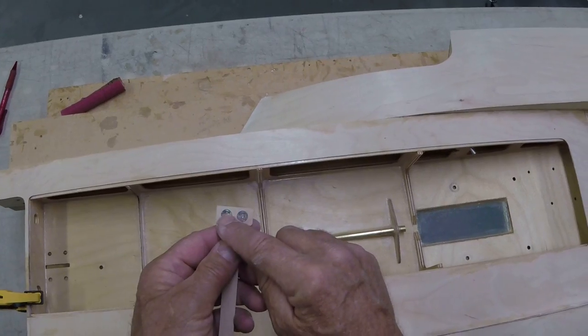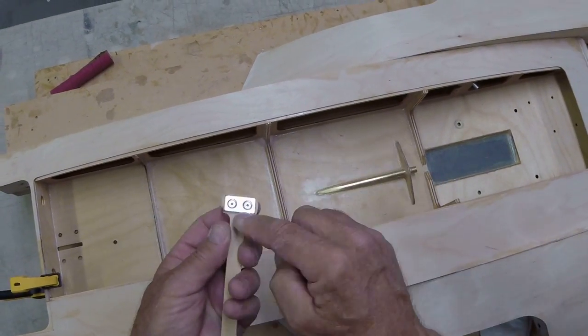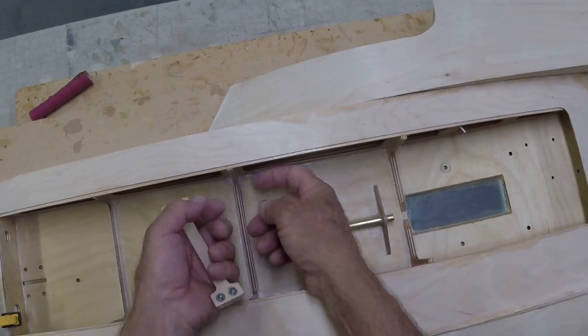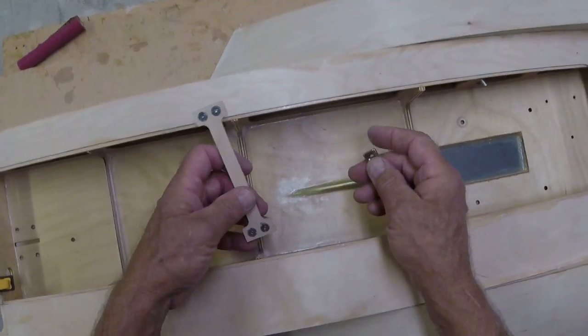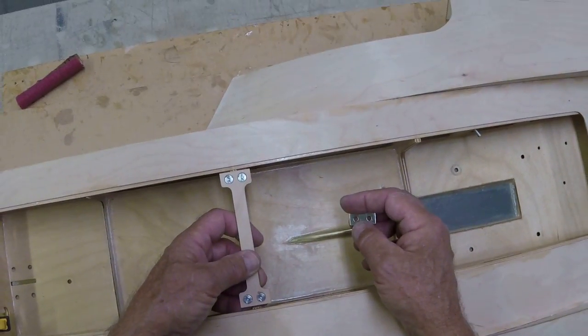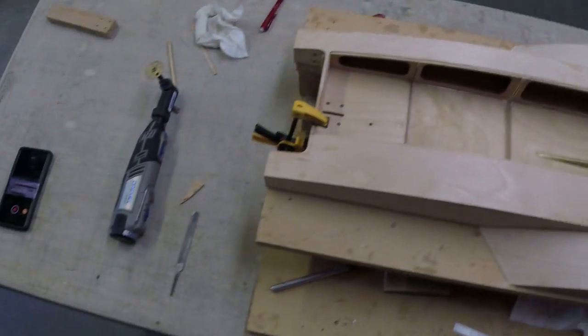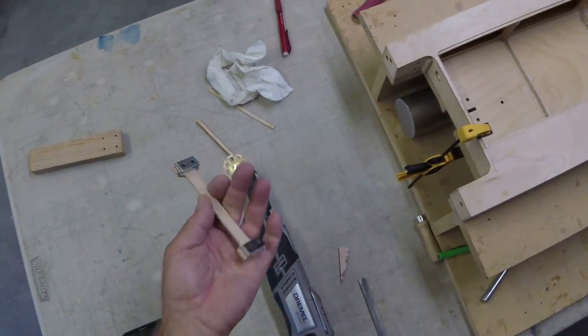We'll be poking these same holes down through that 1/8 inch piece so that you can put your 440 blind nuts on the backside. But you don't need to recess them like this, obviously. They can stick down there, no big deal. We're going to glue them in place and everything because we don't want them falling out if a screw falls out and that sort of thing. Okay, all right, I'm going to show you more here after a bit, so don't panic. Just start cutting. You'll be fine. If you cut too much, you epoxy it back up. No problem. Isn't that awesome?